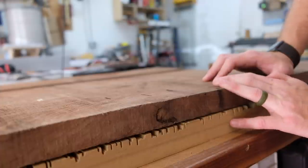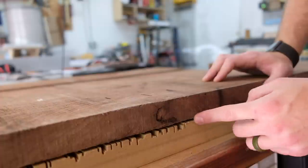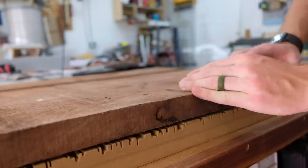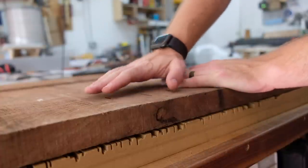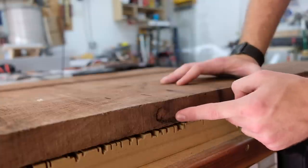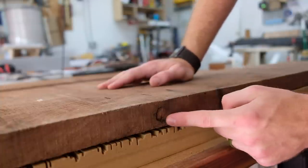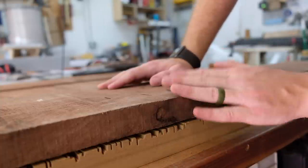So one thing I just discovered before cutting this material is I have this defect right here. I don't know what it is — some sort of inclusion or knot or something. And I can see actually part of it right here, which I didn't notice at first. Now this comes right at the 30 and a half inch mark. So what I'm going to do is shift my 32-inch piece over here, and this will be a 30-inch piece for my side. I'll end up cutting this out and not using it. The reason I don't want to use this is that it's on the side that doesn't have sapwood, so I want to use that edge. I don't know how deep this goes or what it's going to look like when I cut into it — it could fall apart, it could be stable, but it's probably not stable. I don't want this looking at me at the front edge of my cabinet.